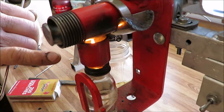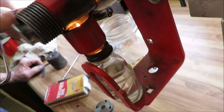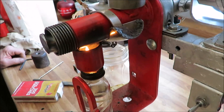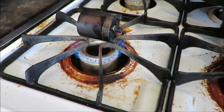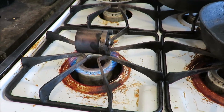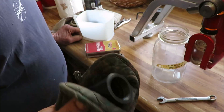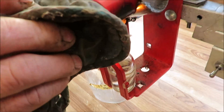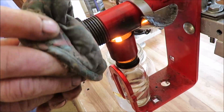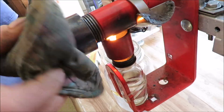We've got the lamp oil flame going to preheat this — we want to get this whole thing hot. We'll let that warm up for five or ten minutes, and in the meantime we're going to warm up this nozzle, which helps once you start squeezing the oil. The oil will produce enough heat to keep it hot. I put the nozzle on the stove for a few minutes just to preheat it, so it's not real hot but just maybe a couple hundred degrees. Now we'll give it a try.